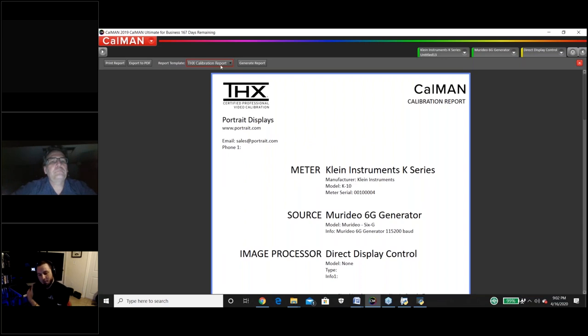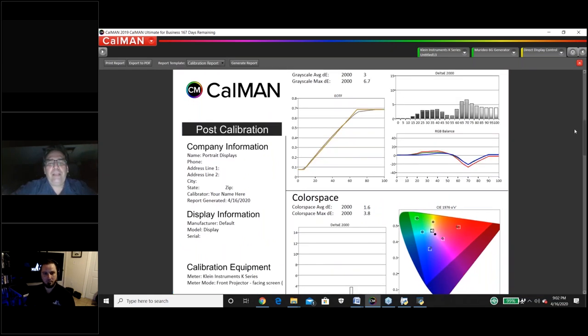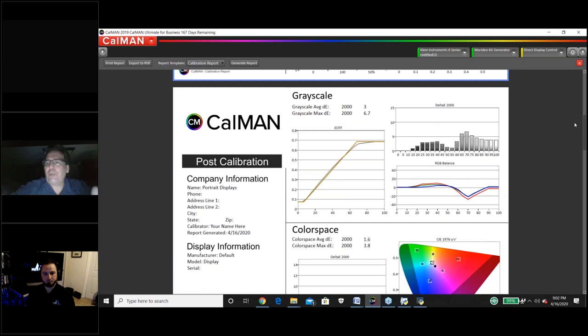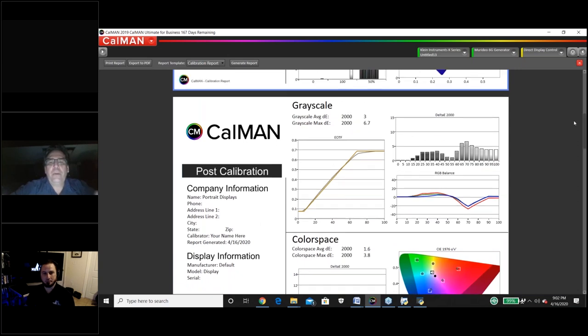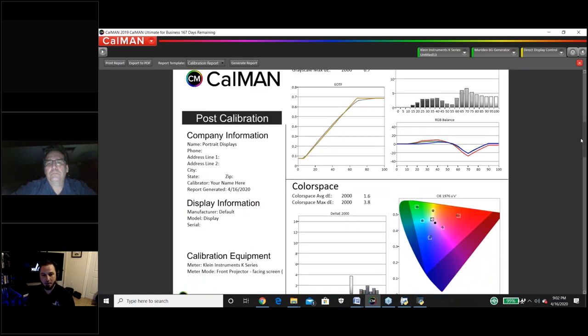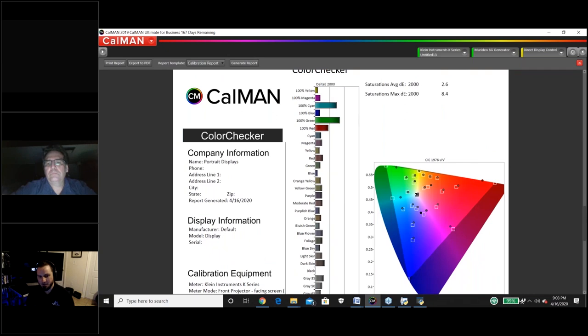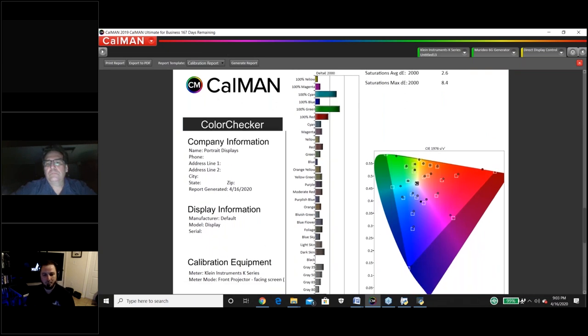So, Gregg, that was really my first time seeing that, and I didn't think it'd be bad by any means, but it was nowhere near as complicated as I thought it would be. Well, the biggest thing is trying to create an EOTF that matches reference. Right, and knowing that you don't have reference on a projector. That's the challenge here. On flat panels, you'll use a combination of picture mode and contrast control, maybe, on some of them at least, but the big trick here is using that program and making the curve.